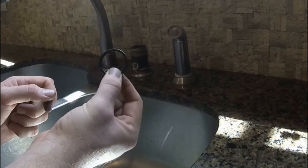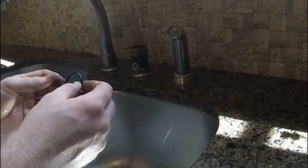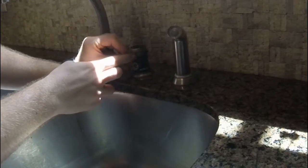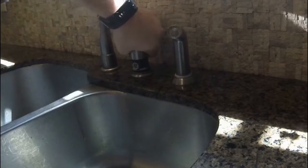With the new O-rings, you want to be gentle because when they're dry, they can get easily pinched or cut, and you don't want them to fail to seal effectively. Be very delicate as you put them on and just roll them down. Try not to cut or nick them on the threads as you slide them down. Once each O-ring gets into the notch, run your finger along and it pops into place. Both O-rings are replaced, so now the decorative collar can slide into place, properly sealed.